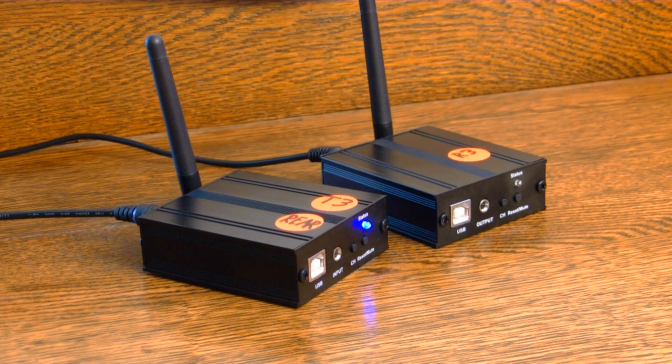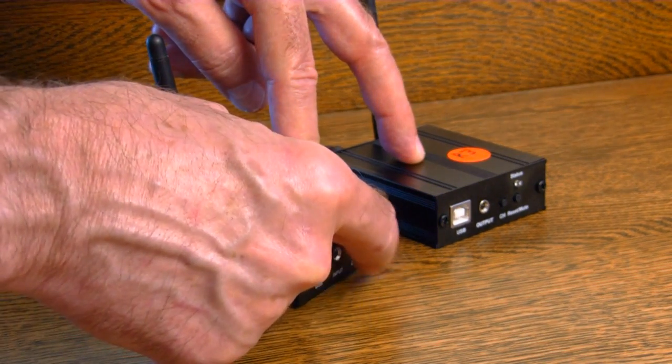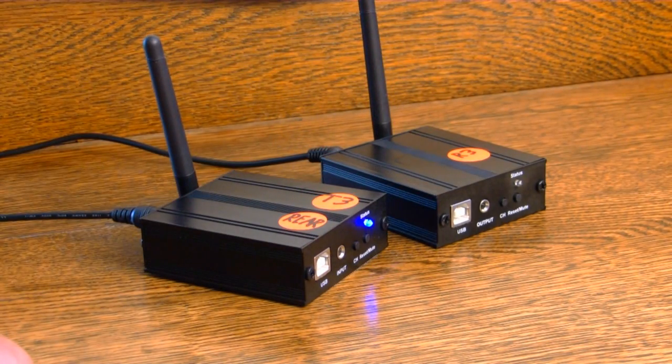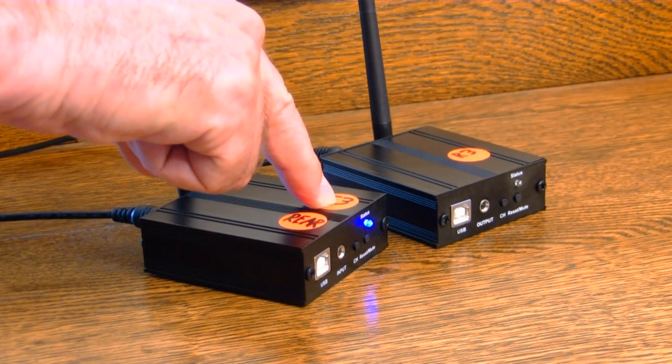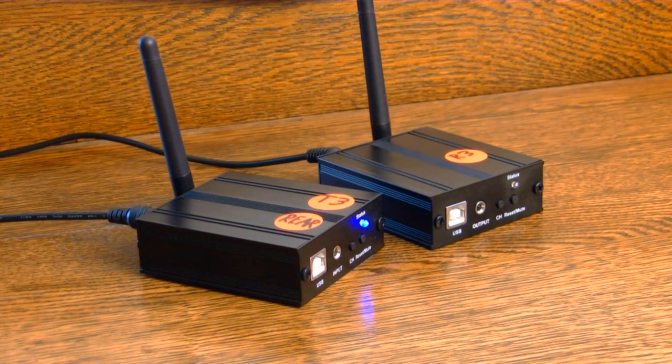And the way you do this is by turning off the transmitters on the other transceivers, and then the receiver lights will come on, which indicates that they are not receiving a signal. And then on your third transceiver, you change the channel button several times and pair it with the receiver. And once it is paired and the transmitter light here is on and this receiver light is off, the receiver lights on your other transceivers should be still on. They should not be off.